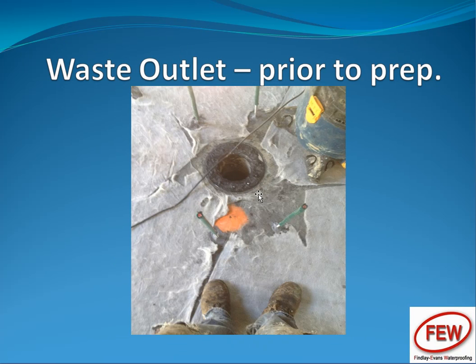This is the central outlet and the white material around here is a Geotech fabric which is an insulator for the old liner that was in there. This was very problematic to remove in such a short time space that we had to complete the work. So, we were asked to actually impregnate the Geotech fabric with the rubber and use that as the base. We went ahead and did that and it was quite successful.